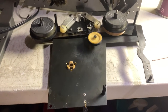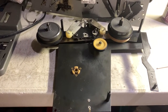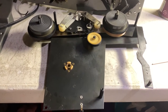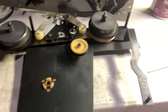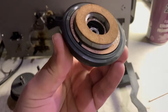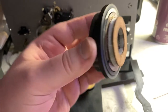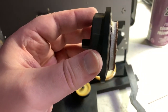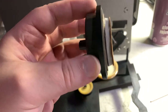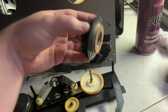Here is the inside of the mechanism where I left off five years ago — I was going to lubricate everything and that's where everything stopped. What I ended up doing back then was rebuilding the clutch. As you can see, it's not the original clutch; it's nothing more than a piece of leather. The padding in between had rotted away, so the spindle never turned.